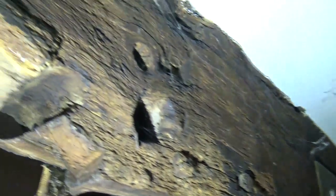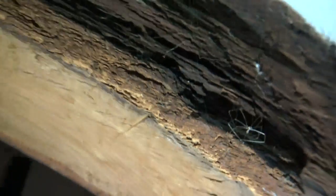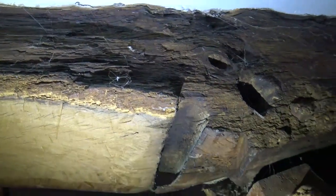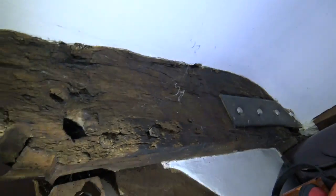We have here a beam and you can see that is oak. You've got sapwood on the outside — this is the sapwood we're looking at — with beetle, and you'll see that they're only in the sapwood on the outside and they don't go through to the oak in the middle. So that's a very good example of a piece of oak with sapwood on the outside that's been attacked by beetle. Those beetle were probably in there when the tree was felled, and then the beam was put in place and dried out.